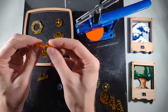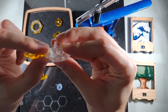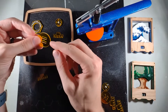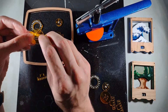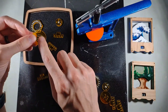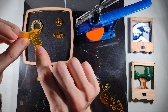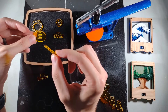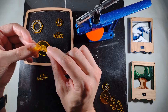When you look at a piece of acrylic like this, there are actually differences in thickness. If I compare these two pieces you can see there's a small difference in thickness between them. So if I make this slot a specific width, there are going to be pieces that will fit and pieces that won't. We want to make sure that this slot uses what we call a running tolerance, so that you could in theory just slide a piece right through. That makes it so that we can ignore the material thickness — no matter how thick the material is, as long as it's within range of that slot, it'll fit.